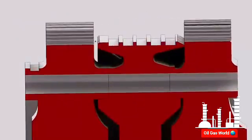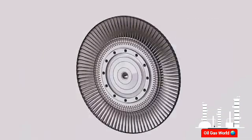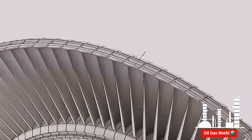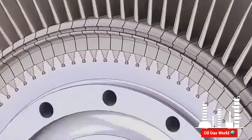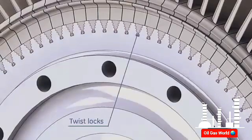The forward face of the spacer is machined to form a gap at the mating surface with the second stage wheel for cooling functions. The third wheel carries the buckets of the third turbine stage. Ninety-two buckets are also installed on the third wheel. Third stage buckets are not internally cooled, and the third stage bucket tip is also enclosed by a shroud. Buckets are attached to the wheel by the dovetail arrangement and held in the axial direction by twist lock arrangement, like the second stage.